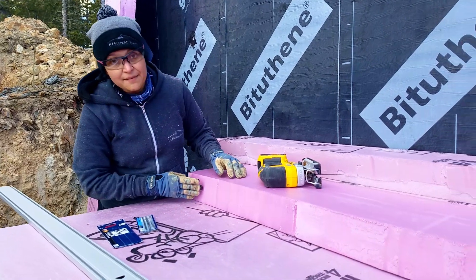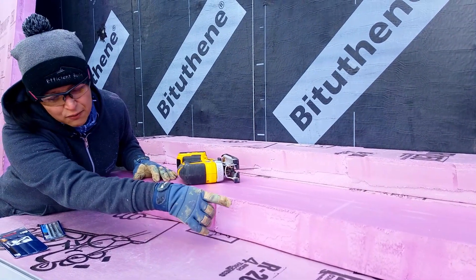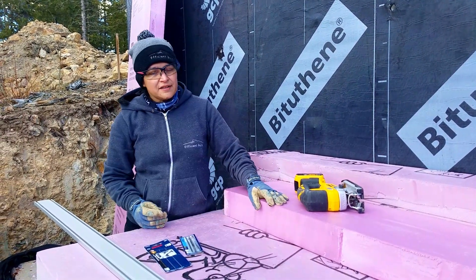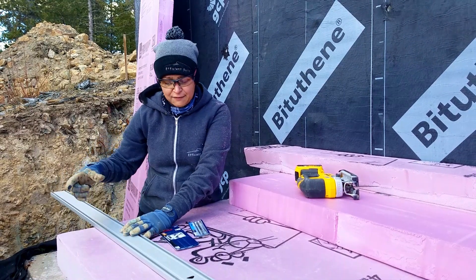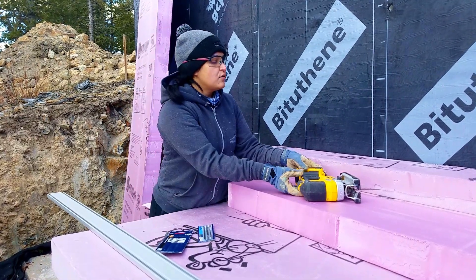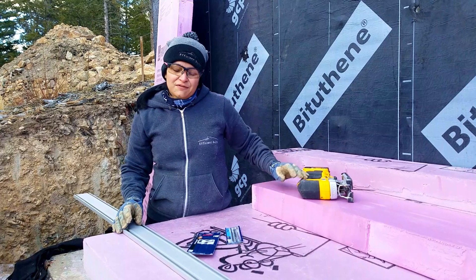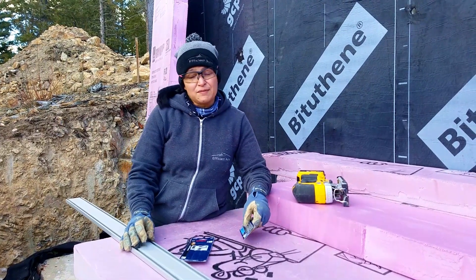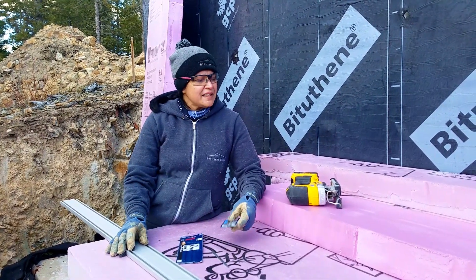Here I can show you the difference. This cut I made on speed 7 going really slow, and this one is also speed 7 but going fast — you can see all the imperfections. The blade starts bending and you end up with bellies and concave shapes in the material. To make the work easier we got guides, and with the sled on speed 7 it's the best way to go. As for blades, we didn't find much difference between the soft-material blades and the metal high-teeth-count ones.